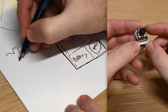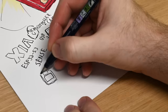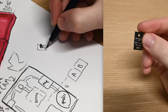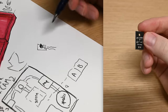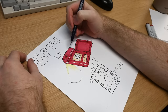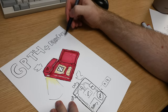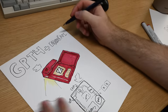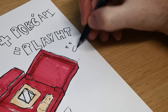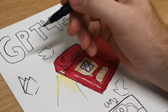The camera we're using is actually a microcontroller as well — it's a Seed Studio Xiao ESP32-S3 Sense Board. For the two buttons, I have small breakout boards which are just a clicky button on a PCB that makes it easy to mount. For the software, we'll call out to ChatGPT to analyze whatever we're looking at and figure out what Pokémon it is. We'll check that against the Pokémon API, which is just a database of Pokémon information. Then we're going to use a service called PlayHT to do a voice clone of the original Pokédex voice. We'll also use a little bit of Firebase, also known as Google Cloud, to support some of the back end.